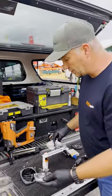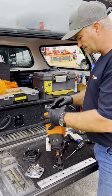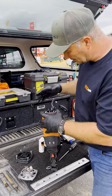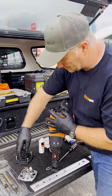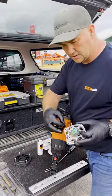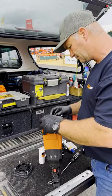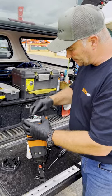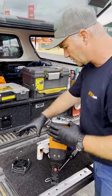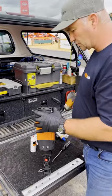That's all the oiling done, and we're going to now reassemble the tool. The first thing you do is put your space ring on — it sits on there nicely. Drop the motor back in; there's a little square hole that goes back toward the handle. Plug your spark plug in, plug your motor in, line everything up, and then those four screws can go back in.